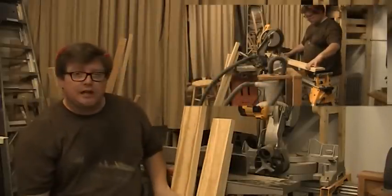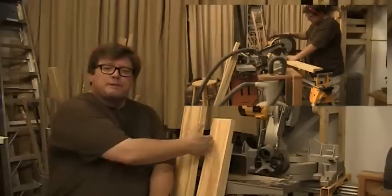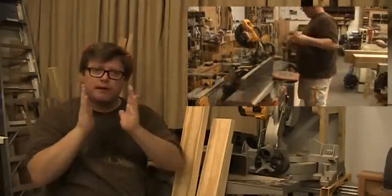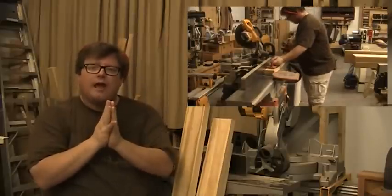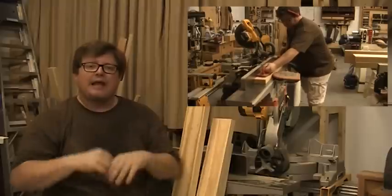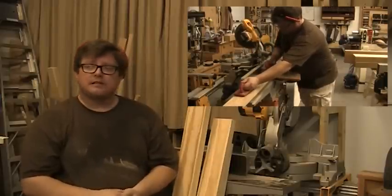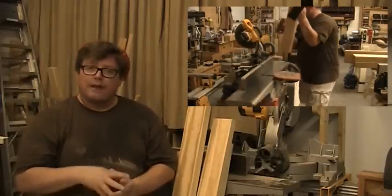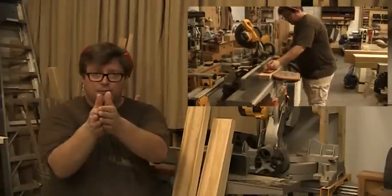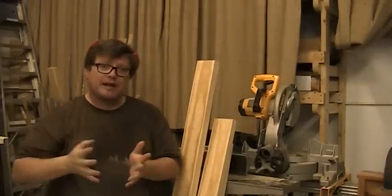What I'm about to do is cut these to length for what the leg is going to be, and then I'm going to joint opposite faces on either board. I'm not going to square them up, just make two faces flat that will glue together. As they sit for four to six hours I will dimension up the leg after the fact, trying to save time. Because of how I selected the wood, I'm not getting too much internal stressing as I push through the bandsaw - a lot of times yellow pine will bow or cup, but these cut pretty much straight.